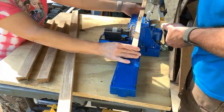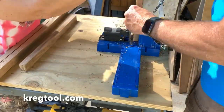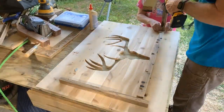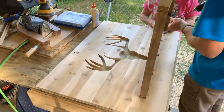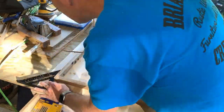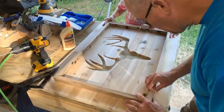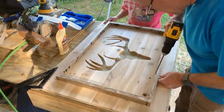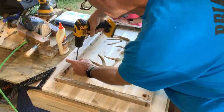After that we're going to build a frame that goes on the back using the Kreg jig. We love Kreg and how it works — puts together good strong joints and is easy to work with. We lay it out on the back, put it together with Kreg screws, which hold really tight. Once the frame is together we lay it down on the back, mark it so we'll be sure to put it back in the same place when we apply glue. We put the glue on the right side and screwed it down — gives you a very strong hold, and this is what your lighting will attach to, keeping it away from the wall for a nice wall wash effect.